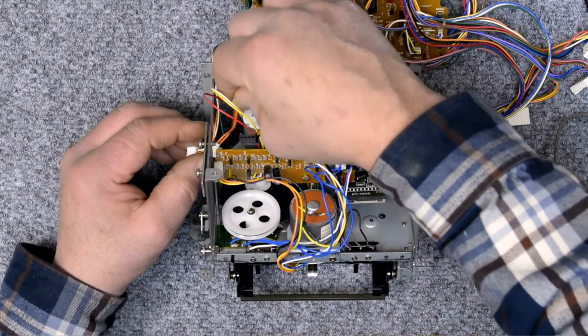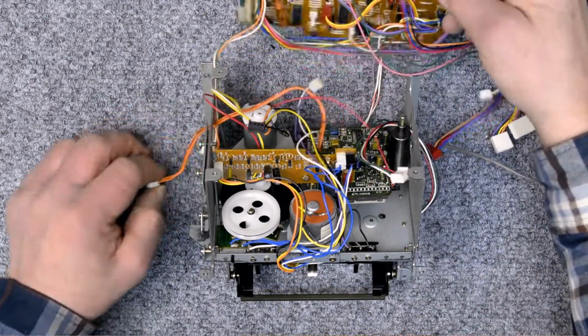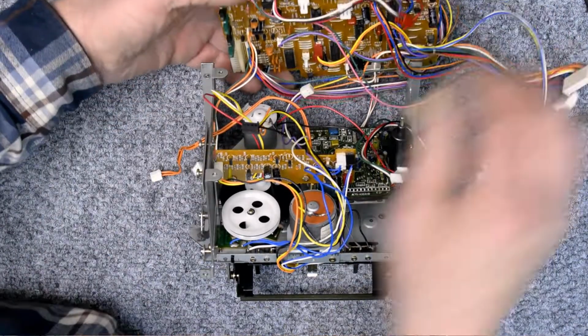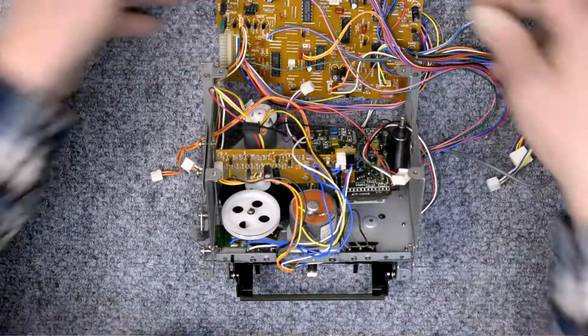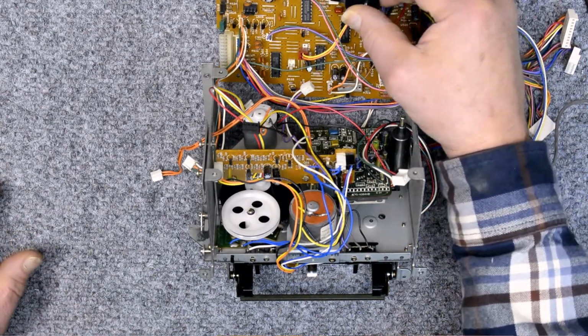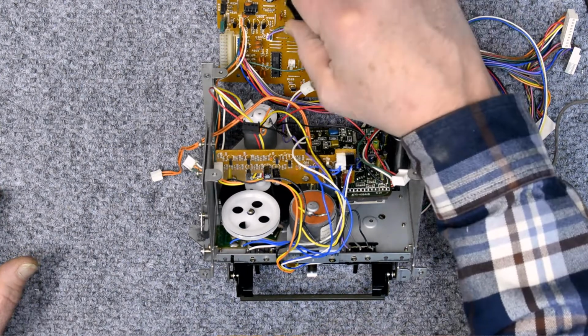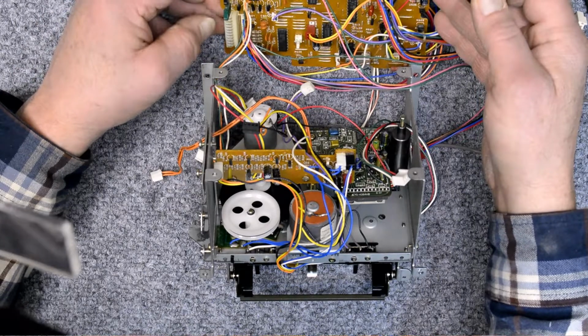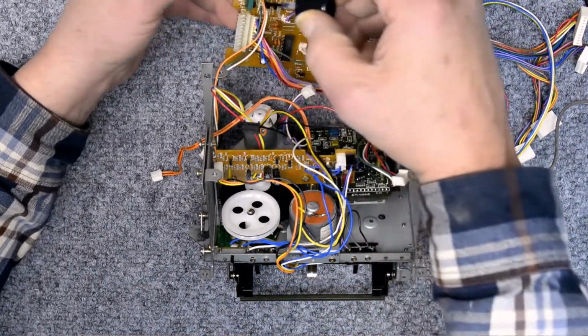See that on this deck, a lot of my wires were in bad shape. The solder joints had deteriorated. Not really the solder, just the wires just fatigued and broke, and so we're hanging on by one or two threads. And of course, after this one, I took a look at the rest of them, and they were okay. All the ones that I've wiggled have broken off, and I've repaired them, and so that's okay. It's good that it happens now.